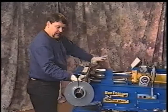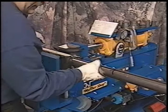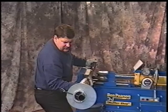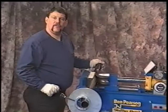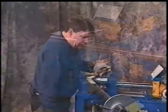Okay, we're going to get back to our second bend, which was at 11.5. Center that line with the center of these dies, okay? Our bend setting is at 73 degrees, so we'll rotate that back to 73 degrees, okay? Snug that machine up. Looks like we've got a 59 degree for your depth setting. We'll back this off to 59 degrees. She's in the automatic mode. We run the ram in, and it'll bend it to 59, and it'll retract on its own.